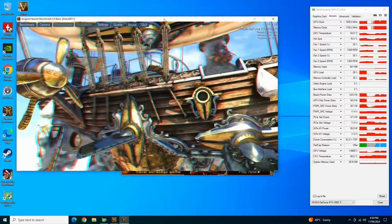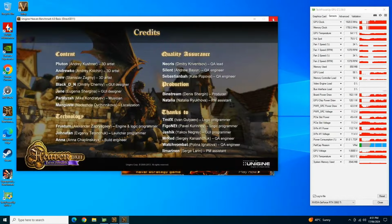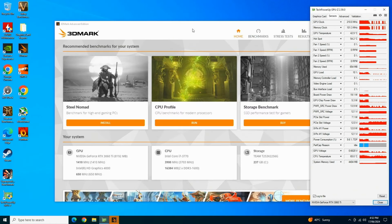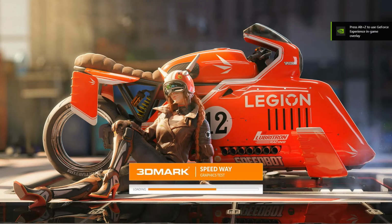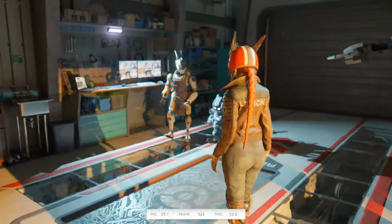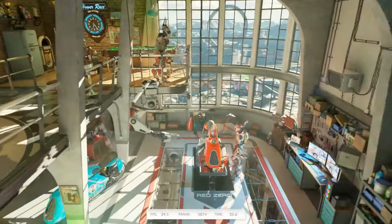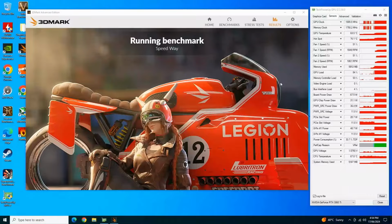So I want to talk to you about a few experiments that I'm doing. Currently, I'm working on some memory upgrades on 3060 Ti, 3070, and there's also a 3080 Ti card that I'm working on. There are some hiccups that I am experiencing with these cards. It's not as easy as it was on the 2080 Ti upgrade that I did. A lot of things. On the 3070, I'm more successful. It does work, but the issue is that it crashes under load.